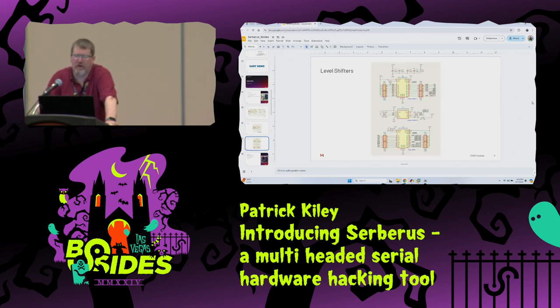Here's a little bit more on the level shifter. The other designs out there had two level shifters. I had to add a third as an additional output buffer. And what those do is they take the voltage level of the FTDI, which is, pretty sure it's 3.3 volts, and shift it up or shift it down.